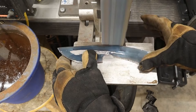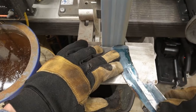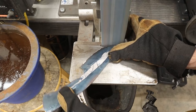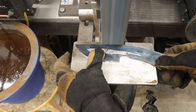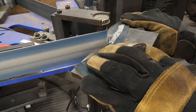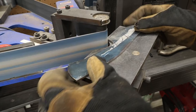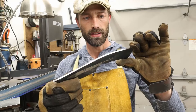We're just refining this profile. I did mark some lines and you'll see sometimes I go through the line. I pick it up, hold it in my hand, and see how it feels. When I get closer to my end product, the lines might not flow exactly the way you want — so this is that time where you make adjustments. If it wasn't exactly what you saw in your mind, it's a form of art. You don't have to stay true to the plan you put on paper. One thing I want to caution you on when wearing a glove: it'll feel different than with your bare hand. Your glove increases the size of your hand, which is also nice because a lot of times you do wear a glove when using a knife. So if you test-fit the knife without a glove and make your whole knife, you might find that when you put a glove on, it's a little small.